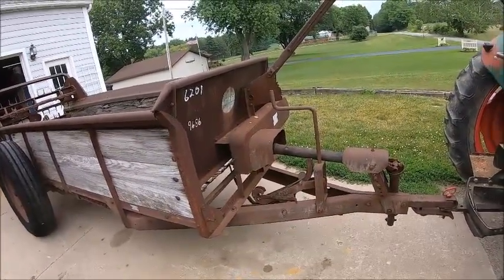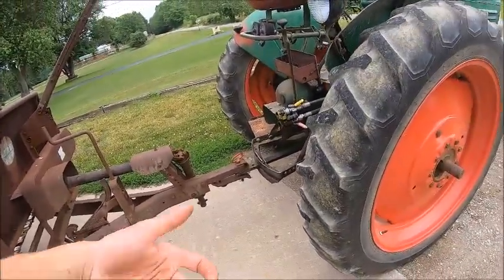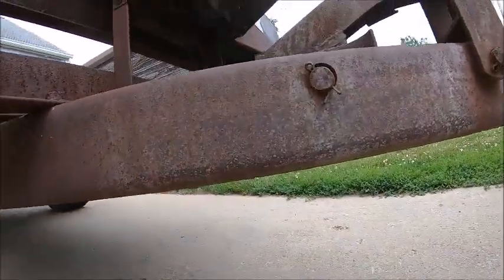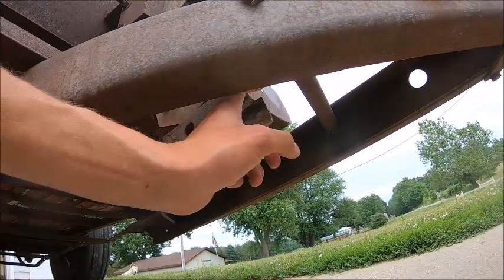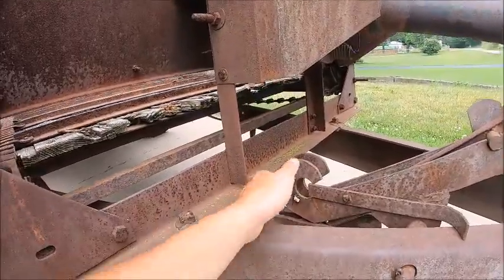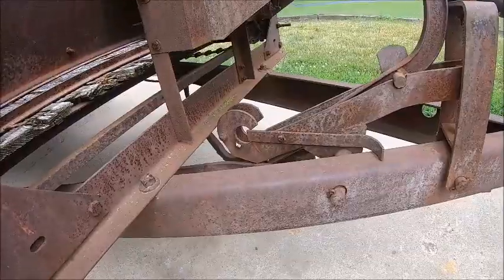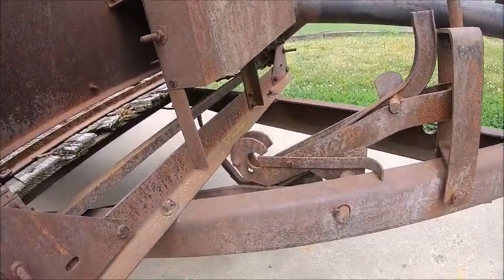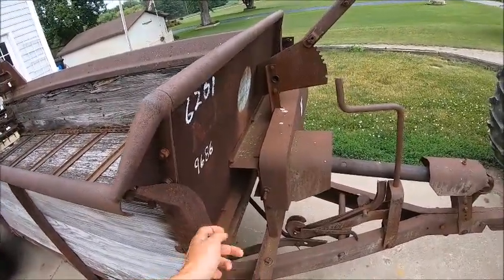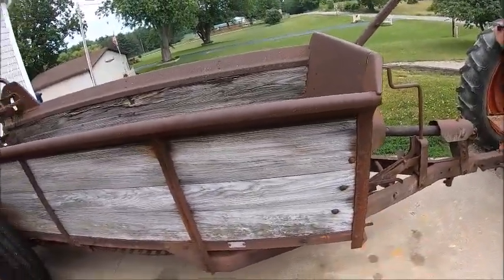But anyway, the other thing I noticed, when you run the jack all the way down, it's still not high enough to get on the drawbar of the tractor. Luckily, this thing is balanced real well, and you can one arm this thing and pick it up and set it on the drawbar. It's actually really nice. But there's supposed to be a great big, well, you can't really see it that well folded up, there's supposed to be a great big arched piece that's welded up here and comes back and loops down and goes back up to here, and that's the foot for the jack, and that's missing. Also it looks like if I move that pin into that hole, that would get me some more up too, so I might do that. But it still needs the foot put back on it. So that's part of the reason I ordered the manual, to get good enough pictures to know roughly how to make that. It'd be nice if I knew somebody around here with a spreader of about this vintage, because when they went to the newer style spreaders, they changed the jack. It'd be nice to find one to get dimensions off of to remake the piece and stick it on there.